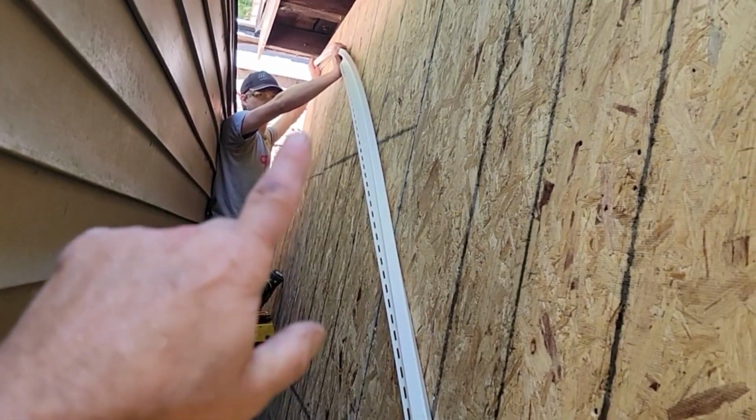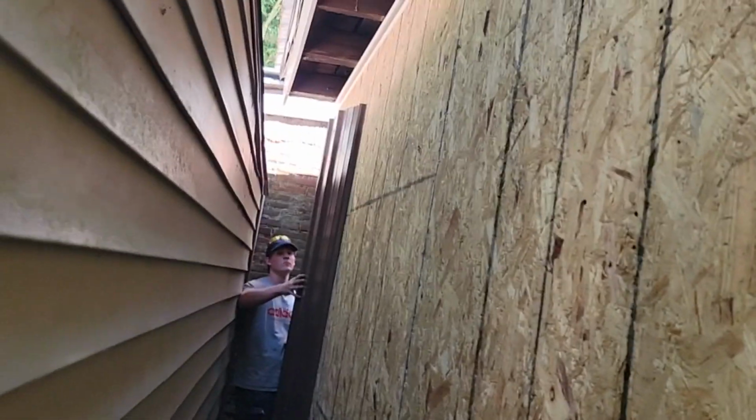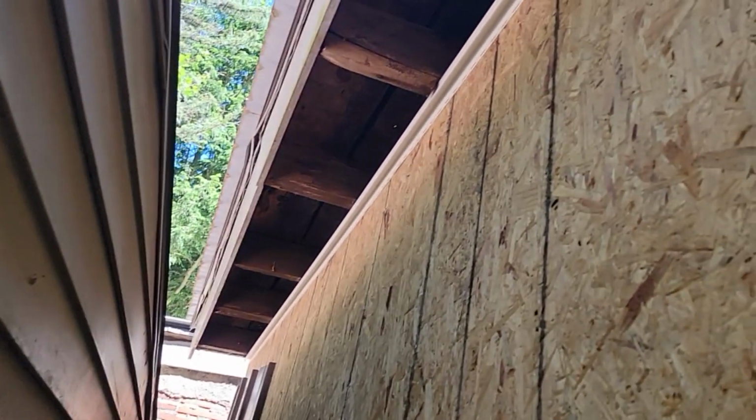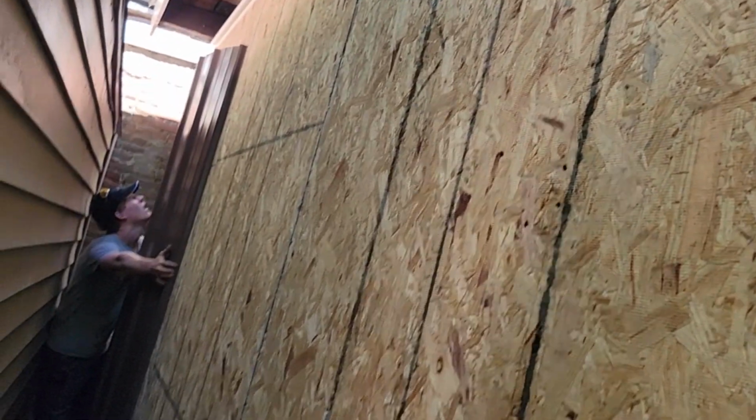He's going to use the air stapler, 1/4 inch crown, and put them up. So we're doing like the homeowner wants. We got the J channel. I got 7/8 up there. That way our roof and steel will fit in.